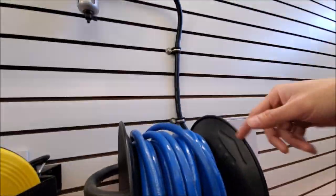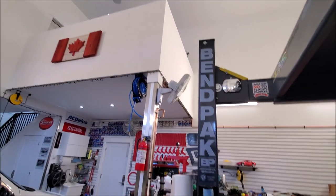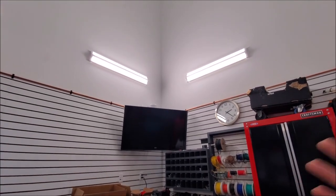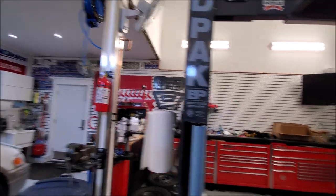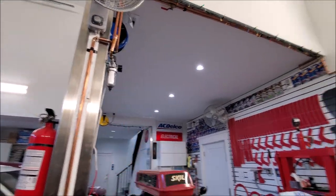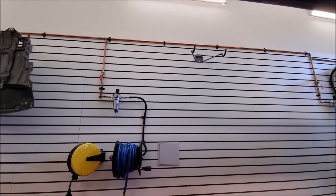Usually you just purchase a new one, bolt it back up, reconnect, and go. It's a pretty simple system. The hardest part was lugging the compressor upstairs — it took three of us to get it up there. I always like having compressors out of the shop floor if you can help it; even without a mezzanine I'd recommend building a shelf, because a compressor on the floor eats up too much real estate. The other hard part was the cost: buying copper, all the fittings, regulators, water traps, and paying someone to do it. You'd save money doing it yourself, but I wanted the best result. So this is stage one — eventually we're adding a cooler and building a box to keep it quieter. Would you build your system like this, or do anything different? Comment below!